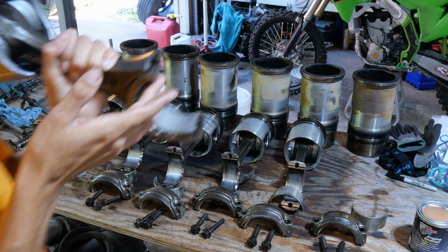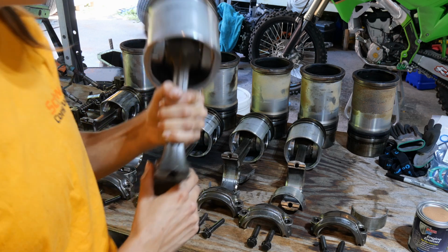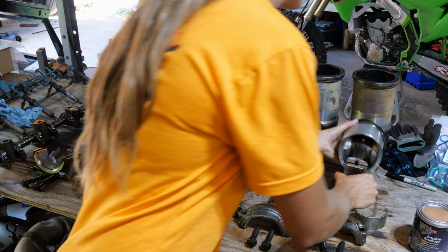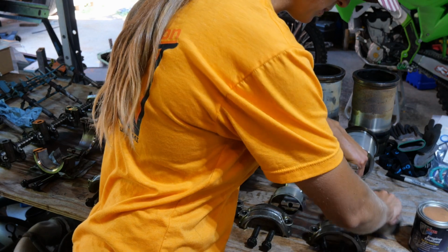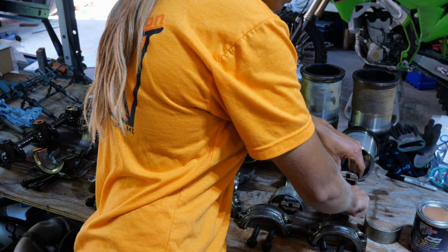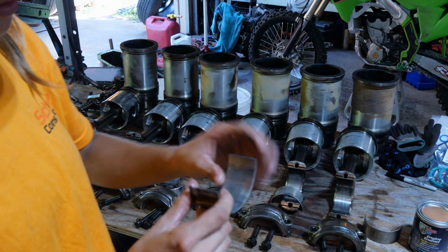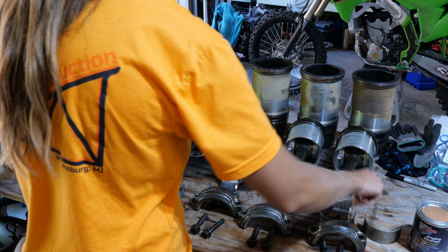So, it's when it's at bottom stroke that it has its most wear, and it comes down around. It's pushing really, really hard on it. You can have super high compression. That's why they can start without having glow plugs in the wintertime. But that's the kind of wear. They don't look too bad. I've seen many bearings that are a lot worse. This is pretty typical wear and tear, especially on heavy duty engines.